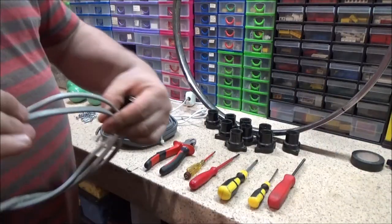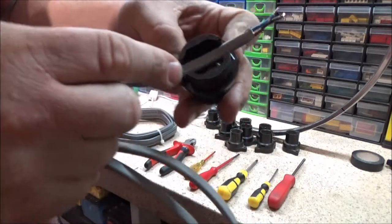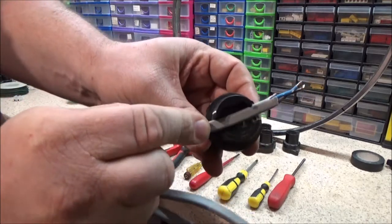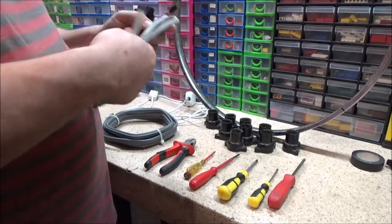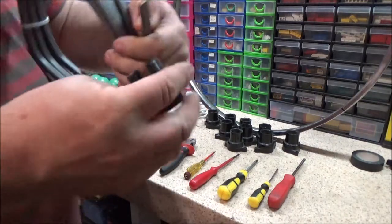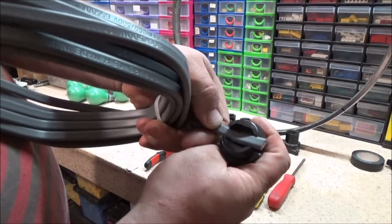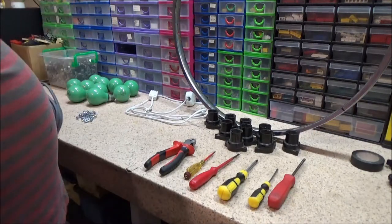So, when I laid the cable in like this, you see, there's quite a gap there. I can move it around. So basically, these pins were not making contact in here. And the one that did make contact was just by luck, pretty much. If I now use this 2.5, as you can see, it actually fills that hole up and this will work. I hope. That's the general idea anyway.